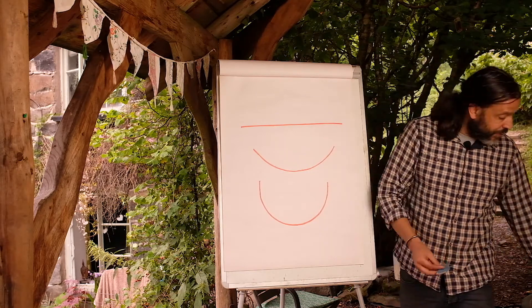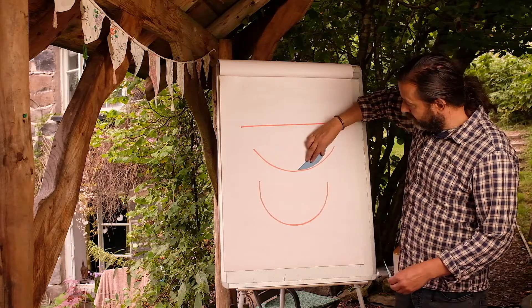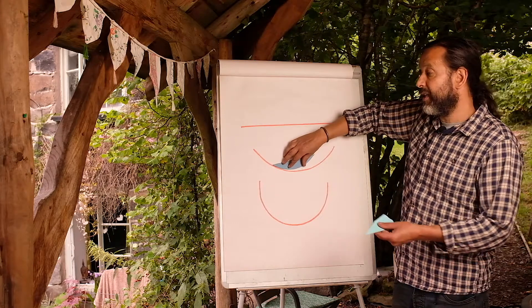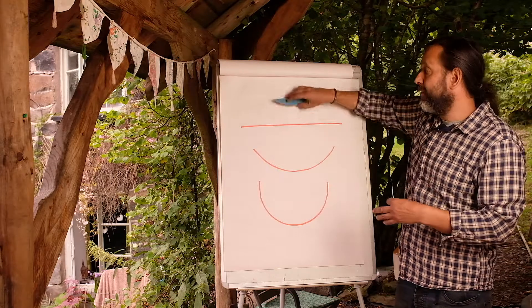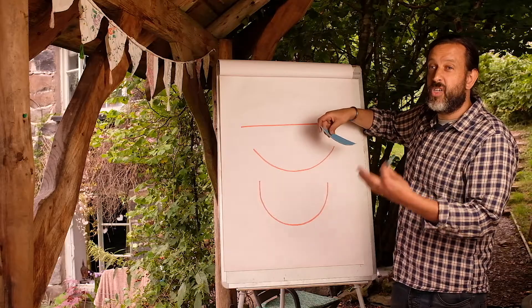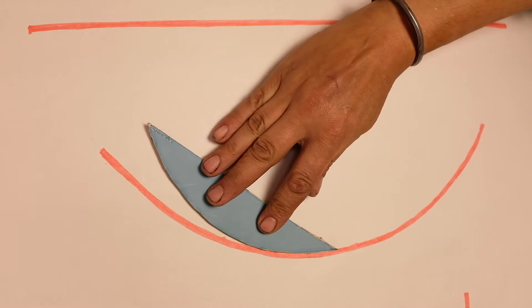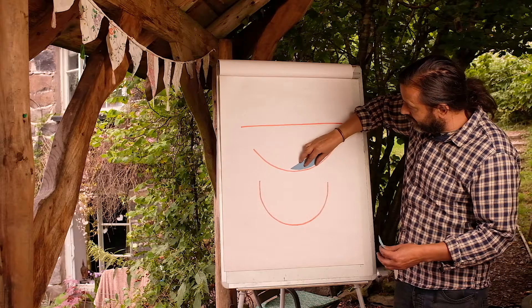So we really want a bevel which matches the curve. This is an example of what would work very well. It's a tighter curve than the bowl, because obviously if you're carving out a spoon there's going to be variation — flat is flat, that's something you'd aim for, but with a spoon bowl it's going to vary, so there's not one curve that fits precisely. But you can see the fit here is pretty good, so you get a decent amount of bevel support when you're making a cut.